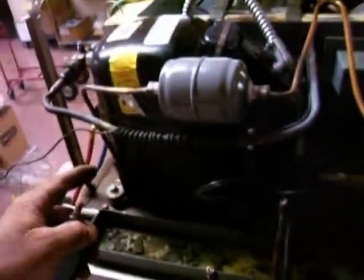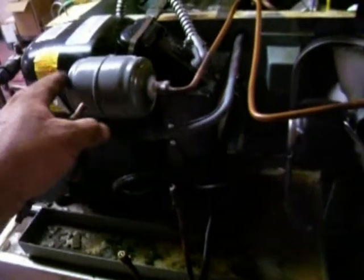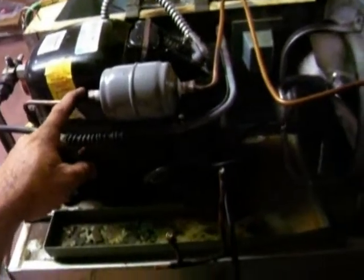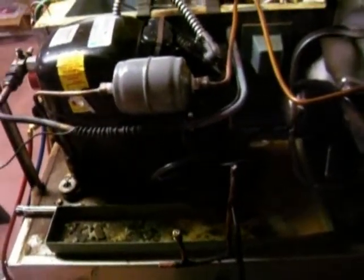Dang, I'm going hard. It's really hard. That sucker's got some stuff in it. Another weird thing is they had the liquid line running down through the condensate evaporator pan. Usually they have the discharge line going down there. I don't know if it used to have one — they cut it out. I'm not real familiar with this exact model, but that is weird.